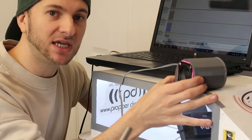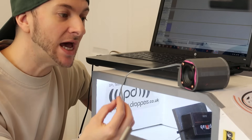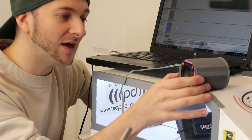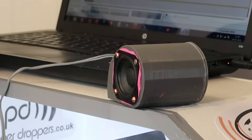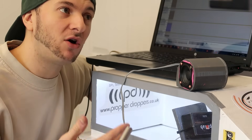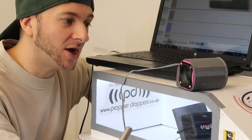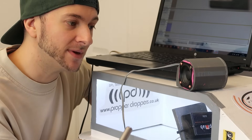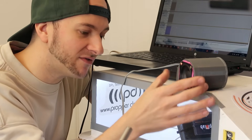At higher levels you can hear it. What I was saying before happens with this driver — I don't know if it's something specific to this speaker, whether it just doesn't have enough mechanical control — but at the higher frequencies when you push it hard, the driver pushes itself out and oscillates around a new centre point. I've seen large subwoofers do that as well at the higher 40 to 60 Hz range, and it tends to be woofers that are relatively soft suspension but have quite high motor force. I don't personally have an answer for that, but I'd love to hear your thoughts in the comments. At 360 Hz it sounds beautifully clean, but again it's doing that thing where it pushes the driver outwards.